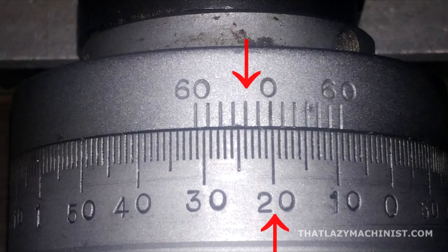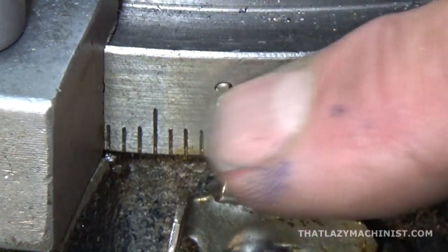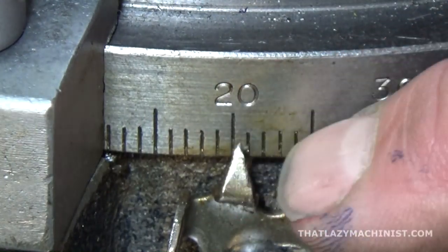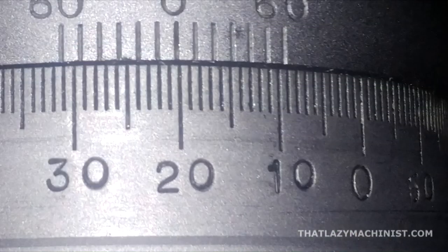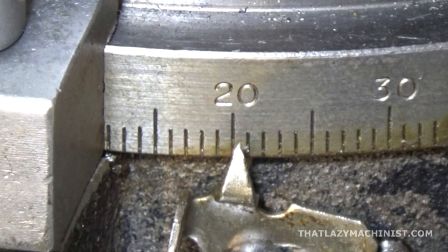I can lock that down. So I'm at 20 degrees and a little more, but not 21 — somewhere between 20 and 21. From my original zero on the rotary scale, I have zero, 10, and 20 minutes. The 20 is just slightly past its marker — the zero of the vernier scale — just a little past. That's expected because I set it for 20 seconds plus 20 minutes plus 20 degrees.